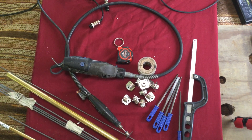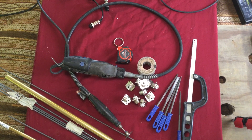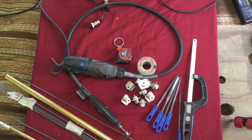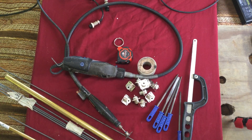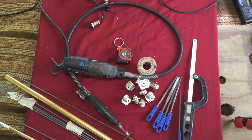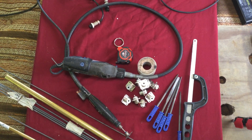I'm going to build a quarter-wave antenna, a five-eighths wave antenna, a three-quarter antenna, a full wave, et cetera, and then we're going to compare them. We're going to compare them in a couple of different ways — we're going to compare them with the NanoVNA analyzer, and then we're going to do some distance tests and compare them to a commercial antenna. I have a commercial Redovus high-gain antenna that you've seen in my other videos. So we're going to compare a home-built antenna to a commercial one and see if there's a big difference.